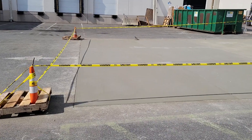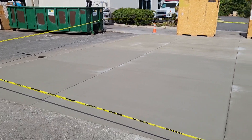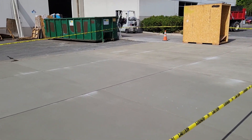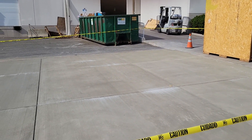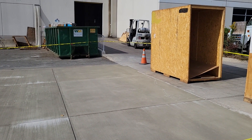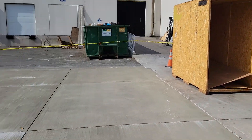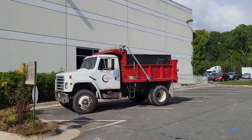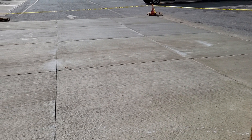Look at that — I think that looks marvelous. I got all my joints cut nice, light broom finish. A nice job for my customer — they're happy. After the concrete got laid, we poured out the trucks, I stayed to make sure they straight edged it good. Then it was just a matter of letting it set up, running the joiner, cutting the joints, letting it set up, and hitting it with the broom. I think that looks great. I had to drive that truck to handle the material, but that's my job and I think it looks nice. I hope everybody has a great day.